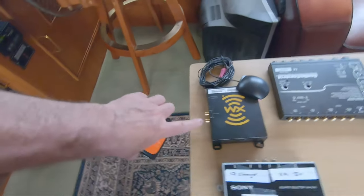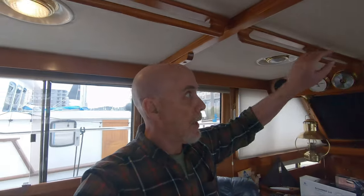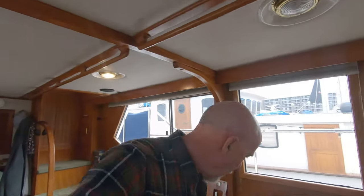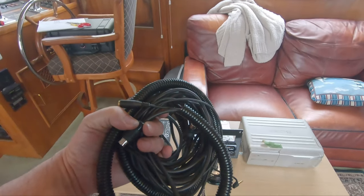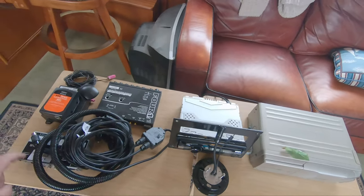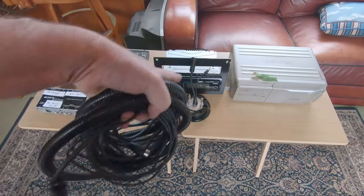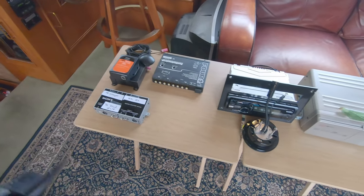The XM box had regular audio output on one side and the XM antenna on the other side. The XM antenna was up on the bridge — we went up through the floor of the bridge and it was pushed way forward under the fiberglass. So then we had a lot of cable — this cable here was basically the long set of cables to run the controller up to the top and to control our splitter. We had one port into here, one port into there, the other port into the head unit, so we could change source.